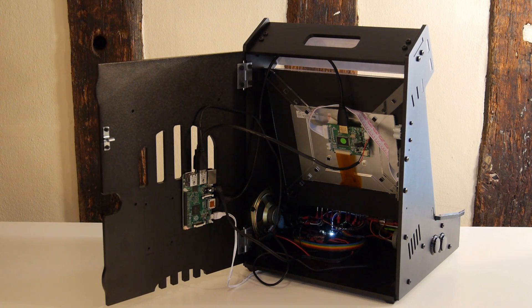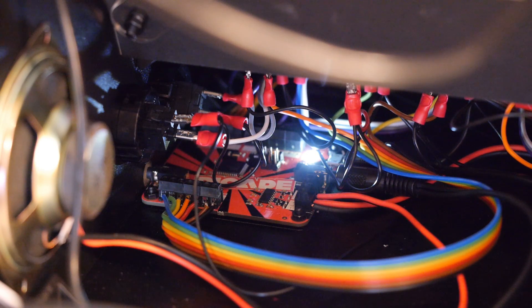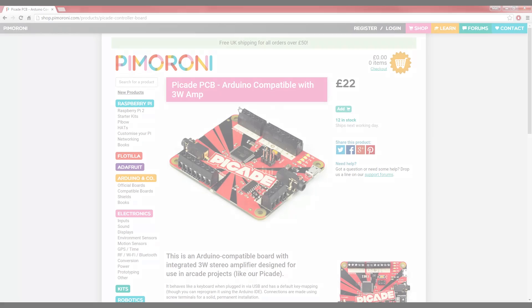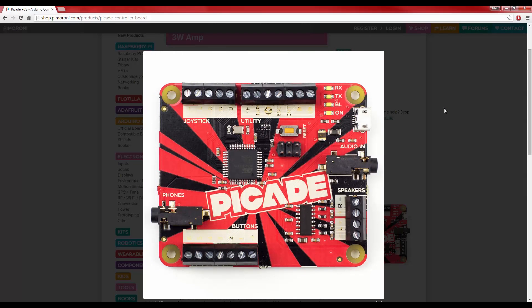The back of the cabinet pops open on a nice mechanism and reveals the electronics inside. On the cabinet door you can see the Raspberry Pi mounted by its screw holes. The PiCade is compatible with the B+, A+, and Pi 2, however it is recommended that you use the quad-core Pi 2 for that added power for the emulators. Note also that there are two more sets of mounts on the cabinet door for both the BeagleBone Black and also Mini-ITX motherboard if you want to use those instead. On the inside, the first thing you'll notice is the 8-inch LCD panel with its driver board, which draws power directly from one of the Pi's USB ports. Down on the base of the PiCade, nestled in wires, is the PiCade PCB. This is also powered by one of the Pi's USB ports, and it functions as a really well-designed Arduino-compatible board that behaves just like a USB keyboard for the joystick and arcade buttons on the cabinet. This allows for really easy control in any game emulators and comes preloaded with PiCade software.